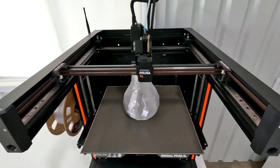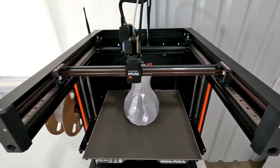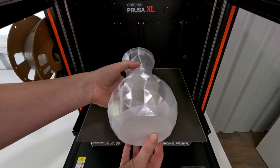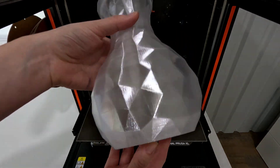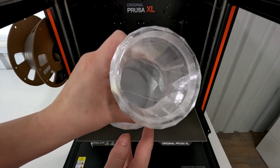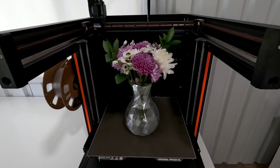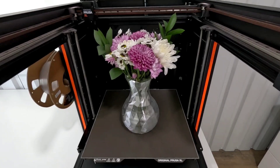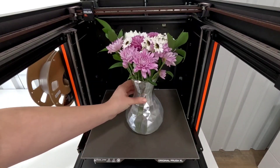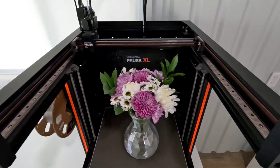I just really wanted to see how the XL would do with the spiral vase mode, and I also wanted to try out the clear PETG — to see how clear it would be and whether the print would work. This print turned out okay. You can see along the bottom that it's not super clear, and there are some really kind of ugly seams. Along the top it kind of has a lip on it and there's a lot of stringing. The size itself works for the flowers and I like that this print is a little bit thicker — if you hand it to somebody it's not going to collapse on them like the previous ones were. But like all the others, it continues to leak.